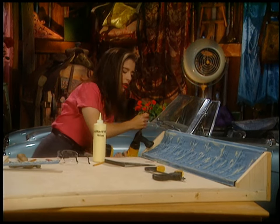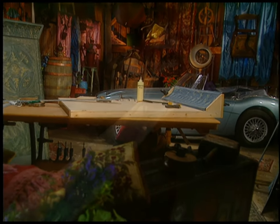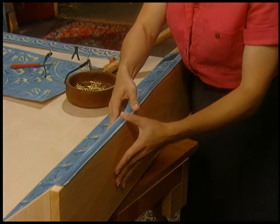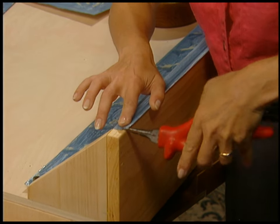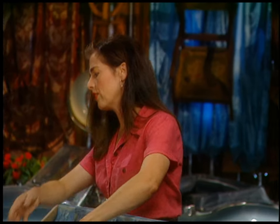I'm packing the crown molding in place now. Because tin is so soft, I can actually bend this lip up so it makes a nice little edge for the shelf on top — that's why tin is so neat to work with. If you find the edge a little too harsh, you can take your pliers and round it over underneath, then just whack it with a hammer to settle it down.